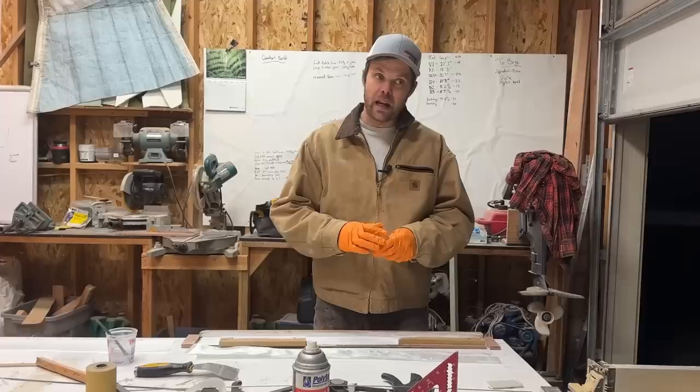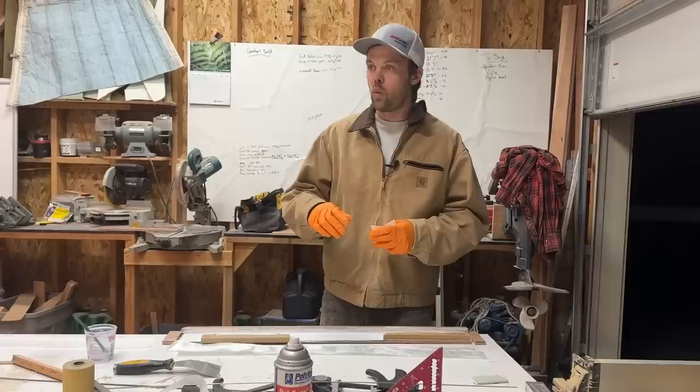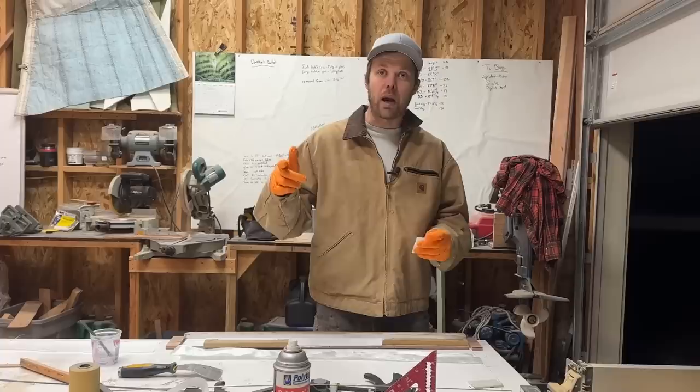One thing we need a lot of throughout the boat are hinges. One problem with building a boat with foam core panels instead of plywood is foam does not grab a fastener very well. And so screwing a hinge into foam, they'll fail pretty quickly. One way to fix that is I could through bolt them with backing plates, or I could insert wooden inserts into the foam for the screw to grab onto. All these things are extra work and extra expense.